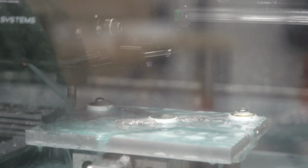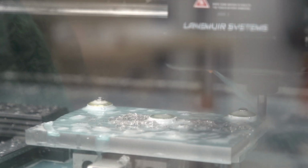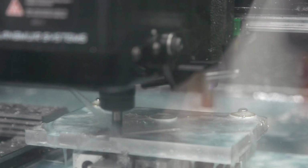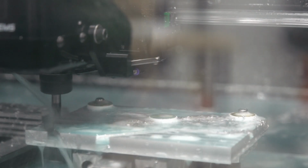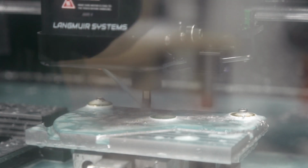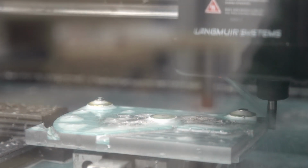The depth of cut is about 3 millimeters, I think. Not too aggressive because, you know, I'm on a fixture plate and there's 3 screws holding this thing down, so being somewhat conservative. But I can kind of tell by the sound, and it really wasn't vibrating at all, that I probably could go as deep as a 5 millimeter cut, and that would have been only like 3 passes, because this is a 15 millimeter plate, or rather part.